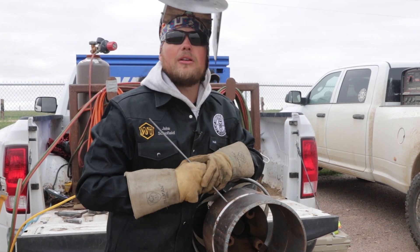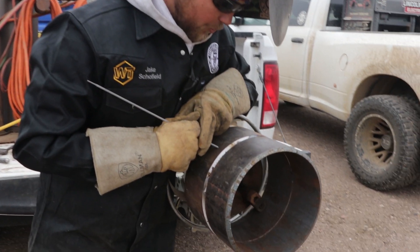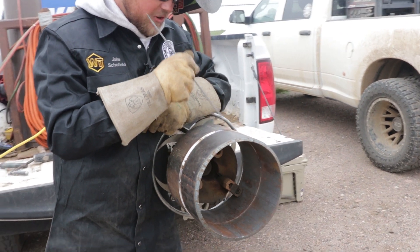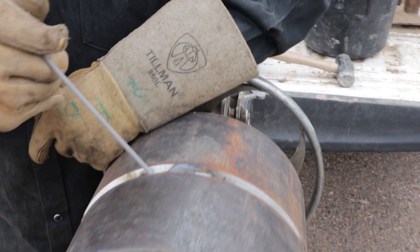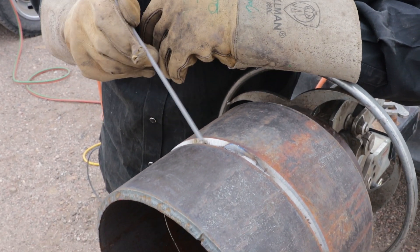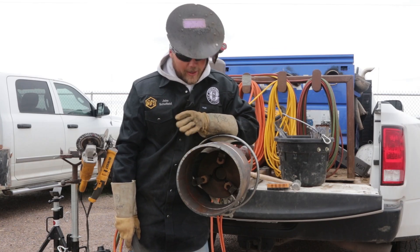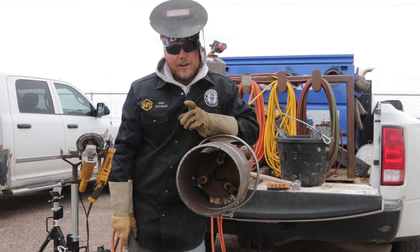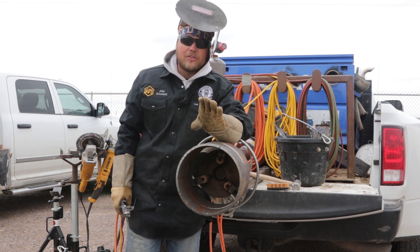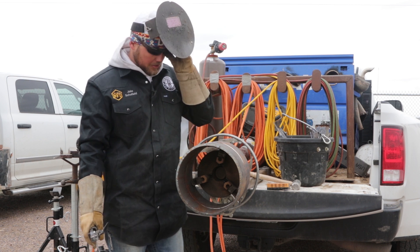On this wide side we're gonna be a little colder — about 91 amps on the machine, and we might even have to go a little colder than that. We're gonna start about a half inch above our tack so we're good and hot, then work our way down the bevel. There's gonna be quite a bit of stepping — coming back up to the puddle and trying to get it to come down with us. One important thing: you can stop on this. It's better to stop than to leave an icicle.